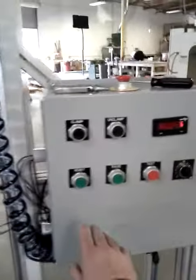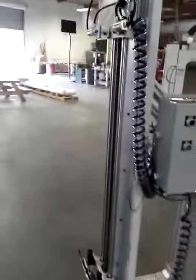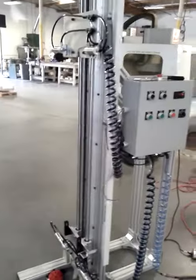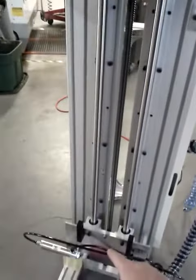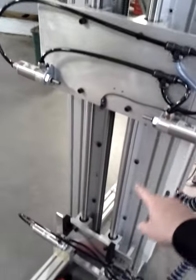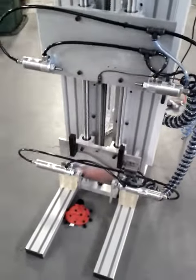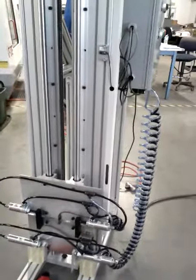What happens is that top carriage comes down and picks up the slave carriage. The slave carriage will hold the test piece. This sends a command for that to come down and pick up the slave carriage. This sensor right here is expecting to see that block right there. And once that gets triggered, these valves will release and hook into these hooks down there. Then it will automatically raise back up to this load position at that sensor, for convenient height mounting.